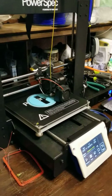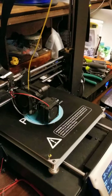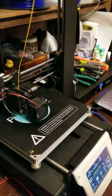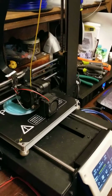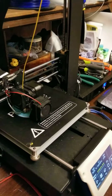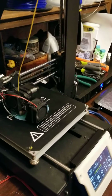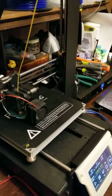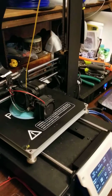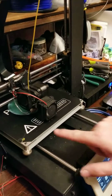That's a little honeycomb pattern, and once it lays down that gold infill, it'll go back to printing the outside rim, which is what you actually see. You never actually see an infill after a print is done. So it's good to change colors at that point. That way there's no discontinuity from seeing it from the outside, and there it goes.